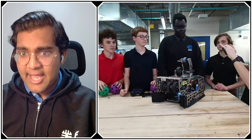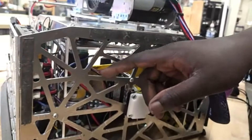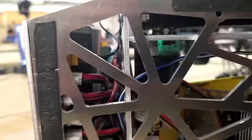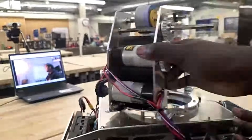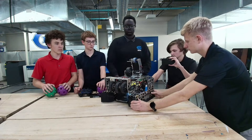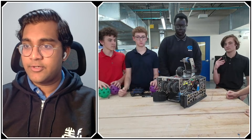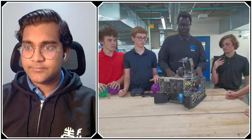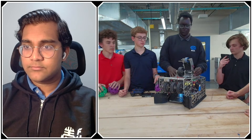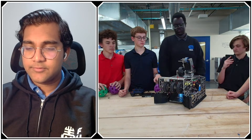Talking about the turret first — how is it powered, servo or motor? It's motor-based. We have a single 435 RPM motor on a 16-tooth gear on the motor and an 84-tooth gear on a lazy Susan, which powers our turret to turn around 360 degrees. As for the software, we zero the turret based off the motor encoder. At the start of each match, we make sure it's fully lined up at the zero mark. At the end of auto, if it runs out of time, we automatically send it to zero even mid-shot to ensure the turret doesn't go off the wall when teleop begins.